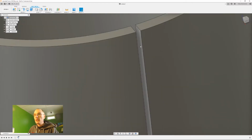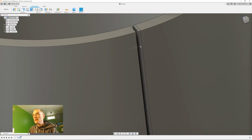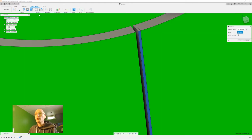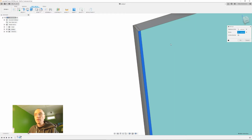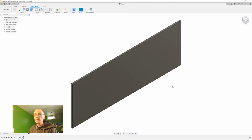We'll zoom in a little bit here, and we're going to select that face. We're going to extrude a 1/2 mil onto that. And so everything is on a curvature except for this 1/2 mil. So we're going to select our flat portion, and then under modify we're going to go unfold. So our stationary entity, which is our flat tangent, has been selected. The bends, we'll now select that, which is the rest of the circle, and we'll hit OK. Now we'll go back to home, and you can see we've now basically flattened out our curve.